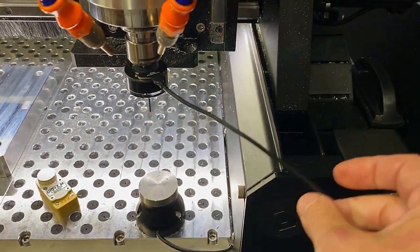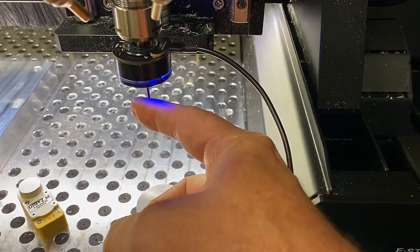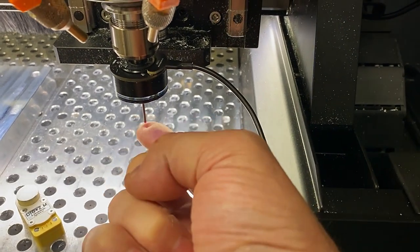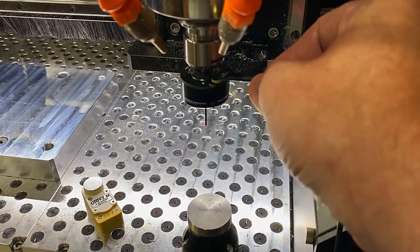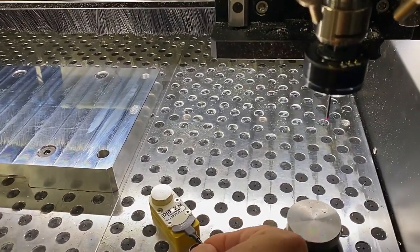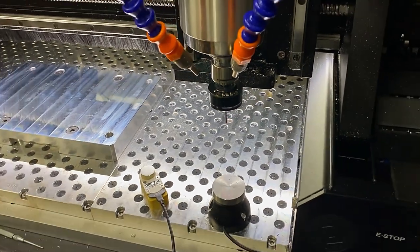In this case, they have magnetic connectors. They also offer wired connectors. The magnetic connectors are nice because I can switch between the 3D probe and the mobile probe. Now, all of these probes get wired back up into a signal merger, which allows me to share the same pin for all of the probes at the same time.